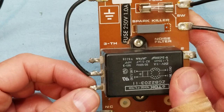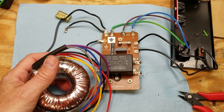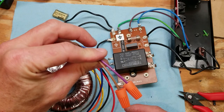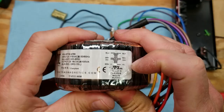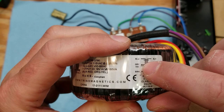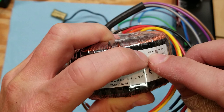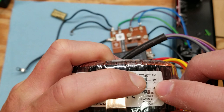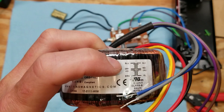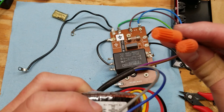This is 18 volts, 18 volts, and then a center tap between the two, going to the transformer as line and load. The toroidal transformer I've got here — I've put Mar connectors on the ends. It's actually a dual input, dual output, so there's a center tap on both input and output. The input is on the blue, gray, and violet, brown wires. If wiring to 240 volts, I would connect gray and violet together and put 240 volts between blue and brown, getting 18 volts on each secondary.